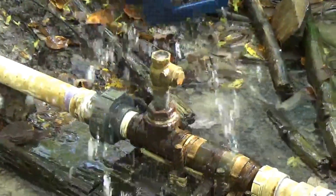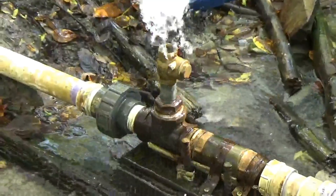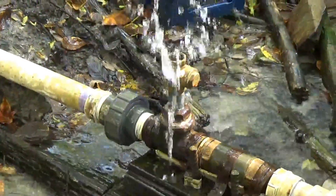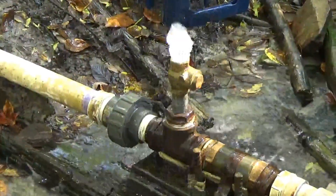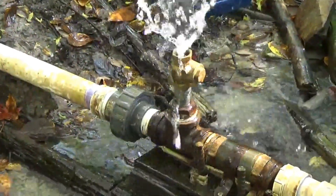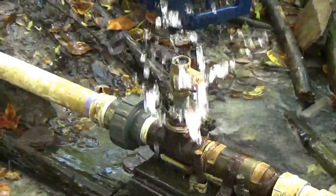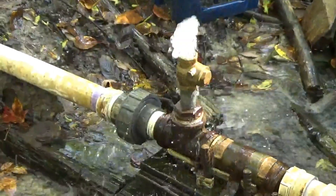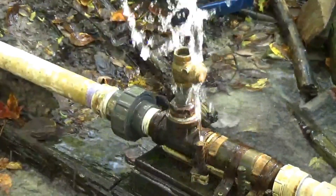So here we are with a three-quarter inch impetus valve on the inch-and-a-half ram pump. It's cycling at about 128 cycles per minute, versus the standard 53 or 54 that the big inch-and-a-half pump with the weights on runs at. With the weights off, that pump runs at about 63 or 64 cycles per minute. Now with the three-quarter inch valve, we're at 128.